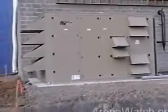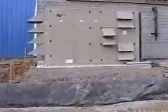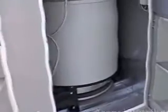which will be servicing the ice rink area, which will be maintaining a relative humidity of about 45 to 50% during all times of operation. We'll have detailed footage on how the ductwork and the sensor packages are put together for this system. This is a desiccant type dehumidifier, which works very effectively for low ambient conditions, which is conditions inside an ice rink. We'll get into additional footage of how the operation of this unit works.